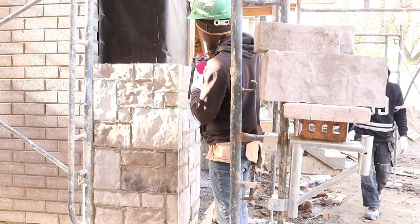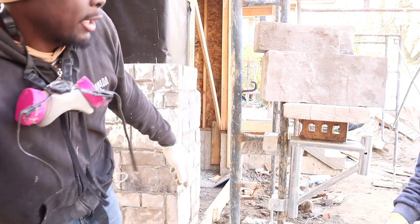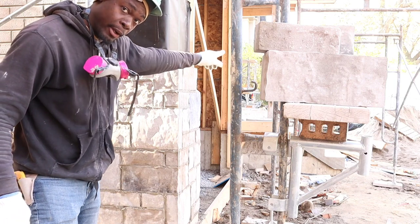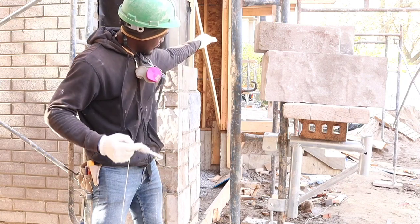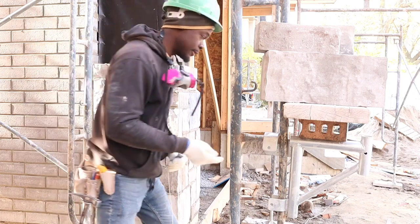To mention this, you want to measure from this end here, which is 4 3/4, and right across on the other side of the garage, you want to put a big nail and measure 4 3/4 over there, and run your line that way. You have this side straight with that side, because later on the wall is going to go right across, right above the garage. You'll see what I mean in a second.